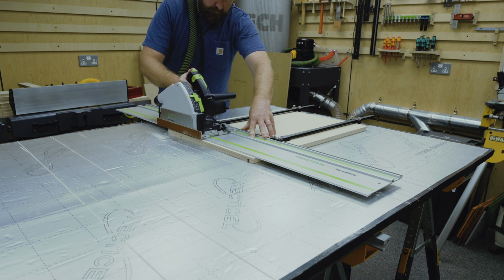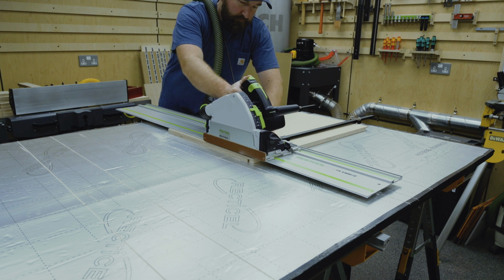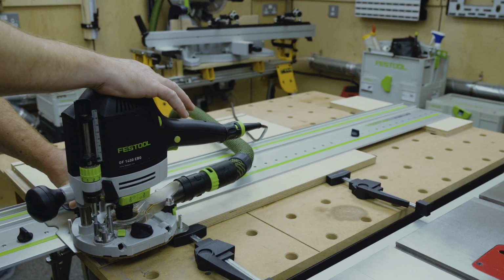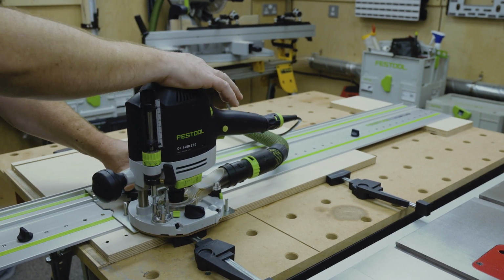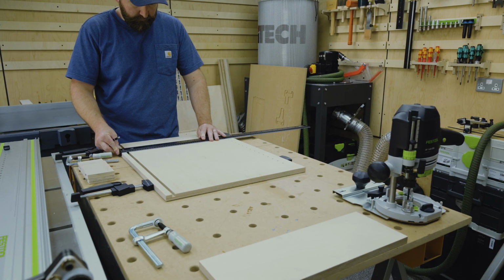To achieve the balanced panel after the fact, I subtracted the height of the rabbet and then shortened the panel so that the remaining height was a multiple of 32. With the panel balanced, the front line of holes was super simple. For the back holes, the included guides were not long enough to use though.